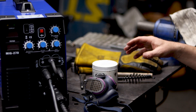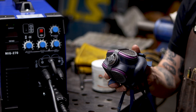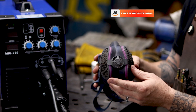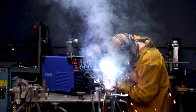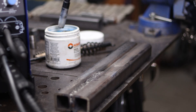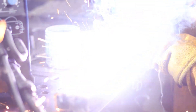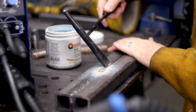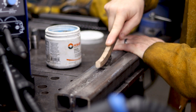Let's get started. A couple of things are going to make your experience welding with flux core a little better. One is a respirator — this is a simple one made by GVS. Get these on Amazon. Everything you see in this video, there's going to be links down in the description. Flux core is smoky, so definitely a good idea to wear a respirator, and I like this one because it is small and it'll fit under your welding helmet. I use a little bit of torch dip or nozzle gel. I just buy the Hobart stuff because it's inexpensive and it's a good brand. I also have a small hammer that chips away the flux that builds up on the outside of the weld, and a stainless steel brush.